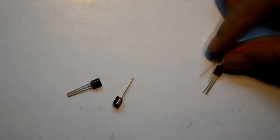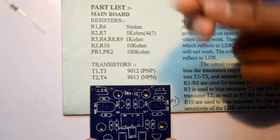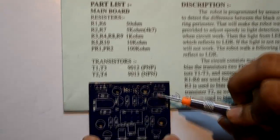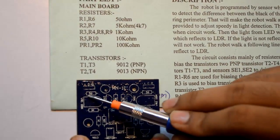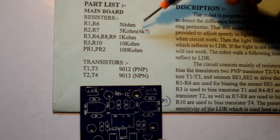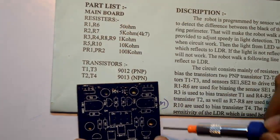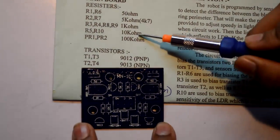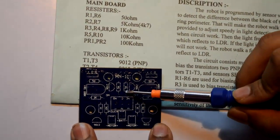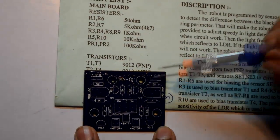Your SPST switch is for turning on and off. The four transistors — two of them are PNP and the remaining two are NPN. Now R1 and R6 are the 50-ohm resistors. I will go ahead and find the 50-ohm resistor. You can see there is a slot for 50 ohm and 50 ohm, so R1 goes here and R6 goes here — or the opposite as you want. Next come R2 and R7, which are approximately 5k ohms — that is 4700 ohms. So just find where R2 and R7 are in the circuit; here we have 5k over here and the other 5k over here, so these two resistors go there. Similarly, complete all the resistors and the presets by soldering them.